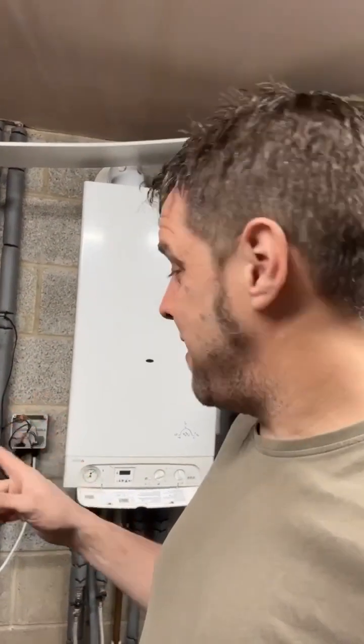The next stage after fitting these sensors is to drain the entire system down and fit thermostatic radiator valves — nice new mechanical ones to all the rooms. Then I'm going to upgrade to either the Shelly one, which does automated thermostatic control at the rad valve, or the Tado one. I'm not sure yet how Tado integrates with the Shelly ecosystem.